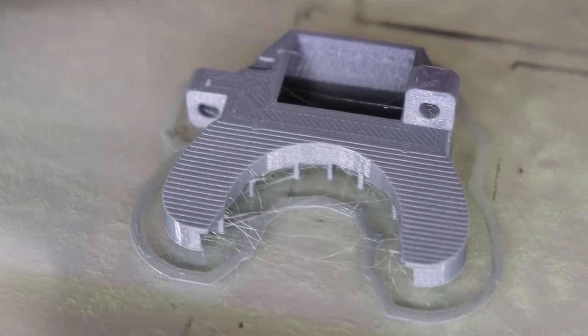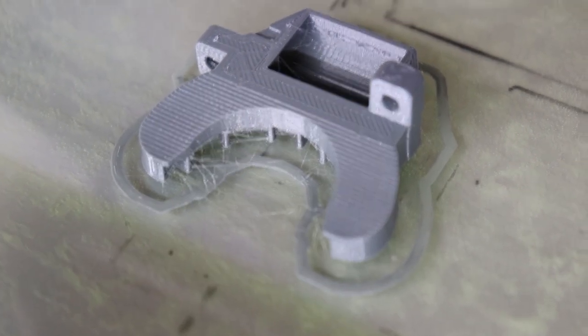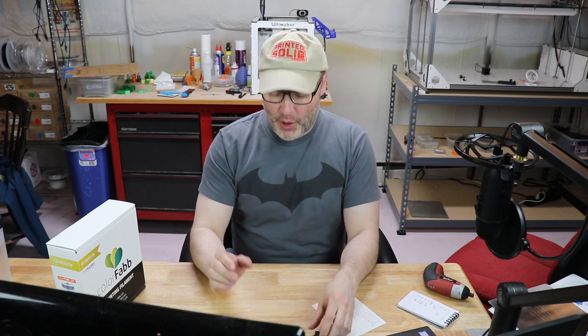Part cooling fan ducts — that's what I wanted to print with this stuff because the project I'm working on has an E3D V6 setup, and I wanted to make sure that if I'm printing this in the right material, I don't have to worry about it falling apart or getting soft in the future. The first print came out pretty good. There was a little bit of stringing. I could leave well enough alone, use the heat gun, and that would melt away those little tiny strings — just like PETG or any other copolyester, this would be considered normal and an excellent print. But I wanted to see if I could do a little bit better. So I increased the retraction distance a little bit, did the print again, and even though a lot of the strings went away, there were a few still present. I felt like I got this material pretty well dialed in.